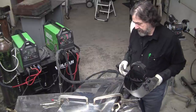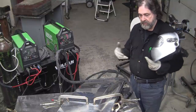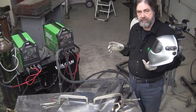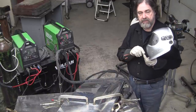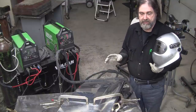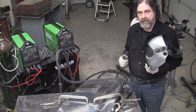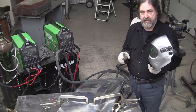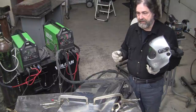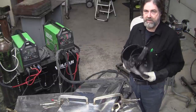During the class, I would always do these little tests where I'd weld two pieces of 060 aluminum together with the TIG welder, prior to the pulse and prior to the argon-helium mix, and 10 times I could weld them together. Looks perfect. I pounded them out, sanded or ground them so that it was totally invisible on both sides. Then I'd go over to the beater bag and hit it with a ball peen mallet right where the weld seam was, and 7 times out of 10 the weld was as strong as the parent metal. And I couldn't figure out why. The 3 times it would break was sort of an embarrassment, especially with 10 students around me. I'm trying to show them how to weld aluminum, and then it broke.